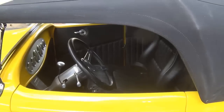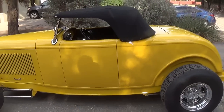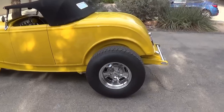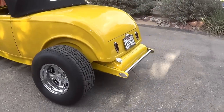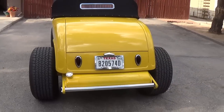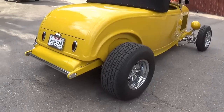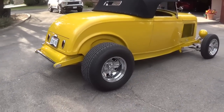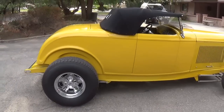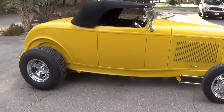And as you'll see in the next video when we go for a ride, horrendously fast. It's a stroked 350, so it's a 383 with about 10.5-to-1 compression and a very radical roller solid lifter cam. So it sounds just fantastic. Sounds like a drag race car and runs like one too. At first I thought that might not be good. You know, I might end up getting in trouble. But no, trust me, it works out just great.